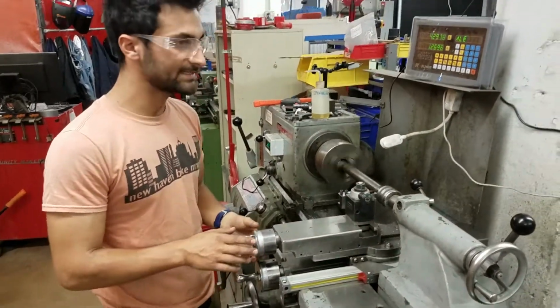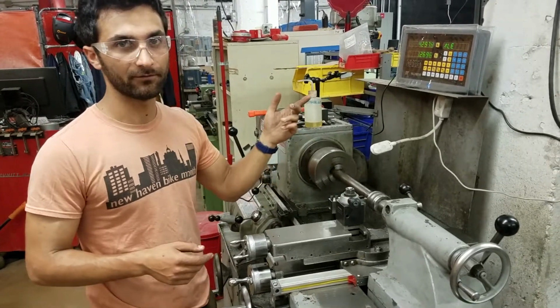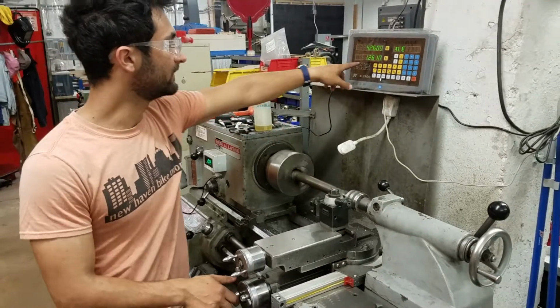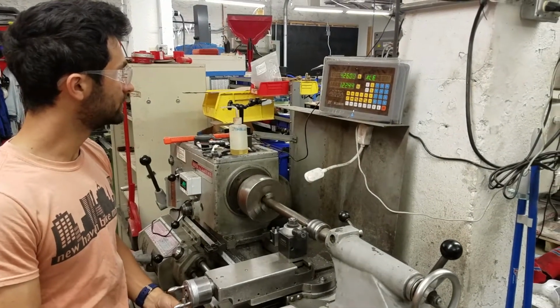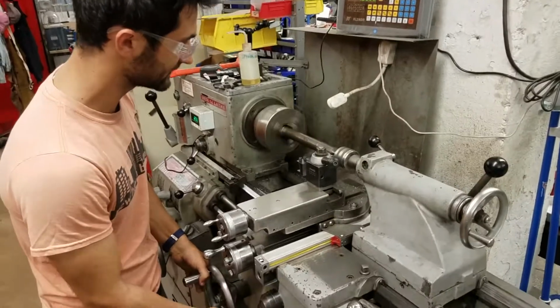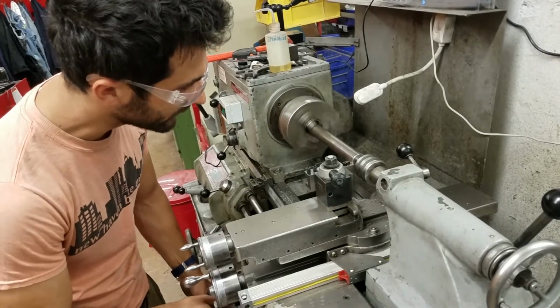And now, let's say we want to take off, say, 20 thou in a pass, so that would be 40 off the diameter. So because we set the zero to the middle, this is going to get 40 smaller. So we're going from 1.22. Here's 1.22. And we'll feed it by hand first just to see how it feels. That's a pretty healthy cut.